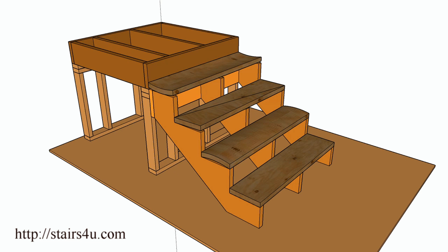That is one heck of an unsafe stairway — obviously I blew everything out of proportion. But if you do install the straightest stair treads and they warp, twist, or flex in the future, make sure you replace them, especially if they become a safety hazard. One of the worst problems with this type of stairway using 2x12 or 2x14s — even 3x materials — is that when they do bow or flex, they loosen up. You might walk up two or three steps that are flat and level and then come to one that is loose.